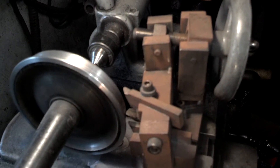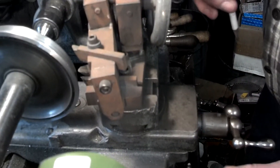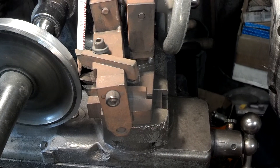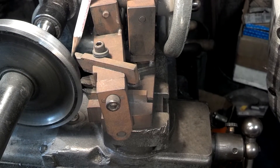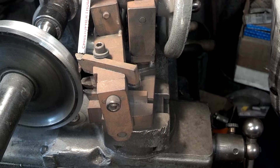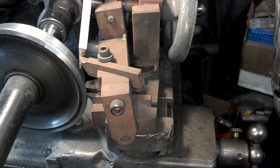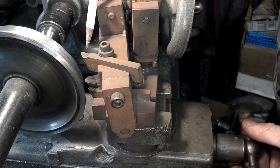Then with the lathe turning you back it off, you turn in ten, and you come in and make a cut. When you're making a cut you're cutting the tread and the flange at the same time, three-sixteenths apart, and you keep turning it in.